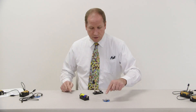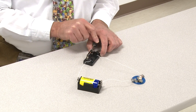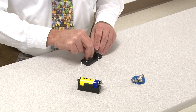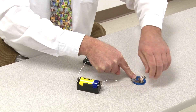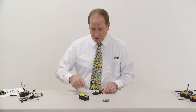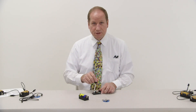This is basically the very same circuit — again the battery and the battery holder, the bulb in the bulb holder — but this time I've added a knife switch. So we can see what happens when I make the contact there, and when I remove it. I'm going to activate the switch, then unscrew the bulb, screw the bulb back in, and undo the knife switch. You'll also notice I have different wires — you might be using wires like these, or you might be using the alligator clip wires. So that's also the simplest circuit, but this one has a switch in it.